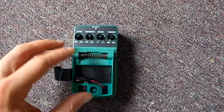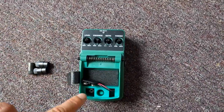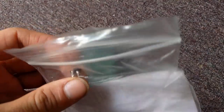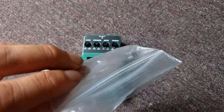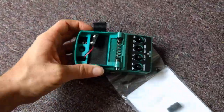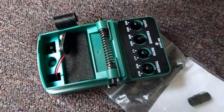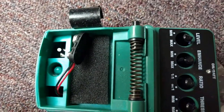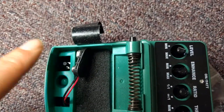I also took off the actual foot switch here because I don't use it as a foot switch, I just use my finger. Rather than push my finger in there to reach the button, I replaced the original six millimeter DTS-6 tactile push button with one that has a much higher height — maybe about five millimeters higher. Now I can push it a lot easier.